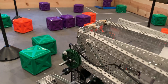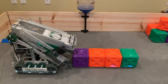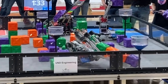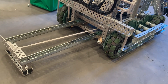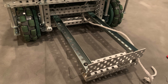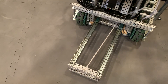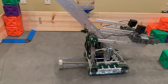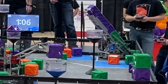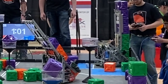The arms themselves are used to deploy the tray, which does not fully flip down but instead rests at something like a 15 degree angle. At the beginning of autonomous, the arms raise up, pushing the tray far enough that the rubber bands take over and snap it back into place. We can also intake a cube to do the same thing — it just depends on which autonomous program we are running. As almost all tray bots do, we have problems with tipping backwards. This was remedied by a simple linear slide that deploys during autonomous. We use an interior slide mounted to the robot to prevent any leverage from breaking the slide free from the rail, and this is pulled out by a set of two rubber bands. To keep the slide inside the bot and within size restrictions, we use a piece of vex string tucked between the lift gears.